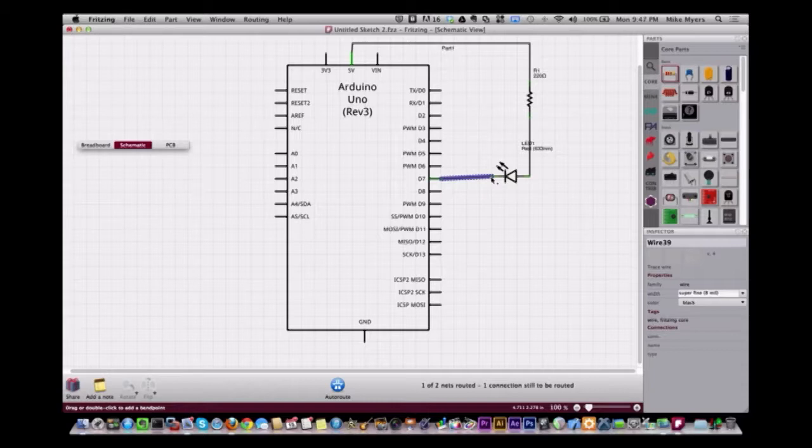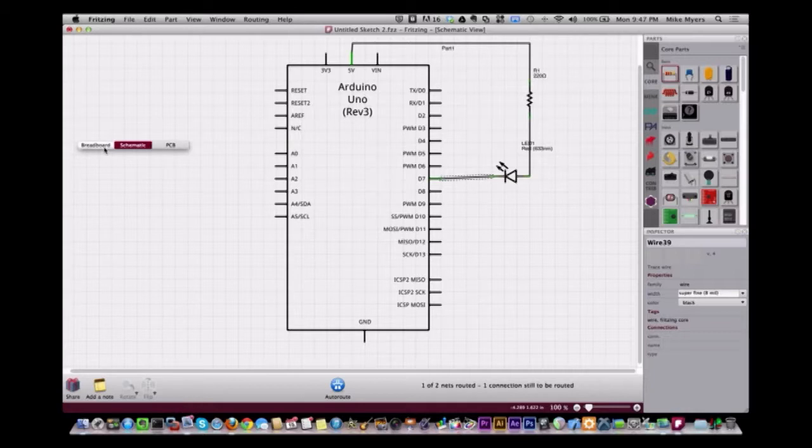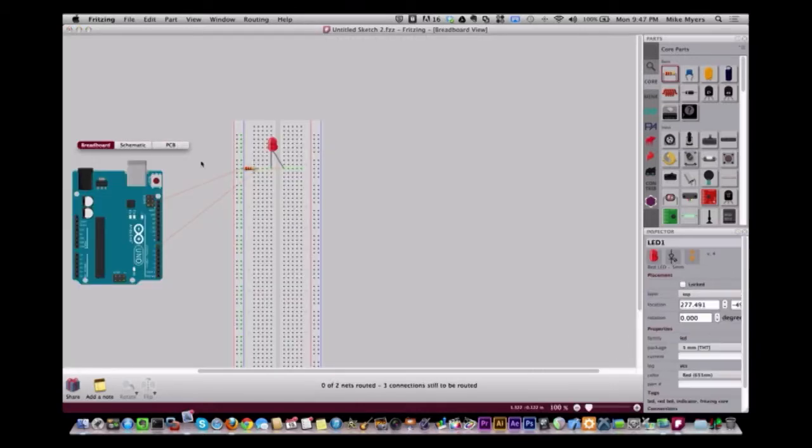Yeah. So the only problem with that is, and why I do a couple of things in the schematic starting out, and I'll show you what I do to get past some of these problems. So very basic, one LED, one resistor, 5 volts, and going to D7. D7 goes low, the LED should turn on. So if you go look at the breadboard, I've got to move this around too, but...